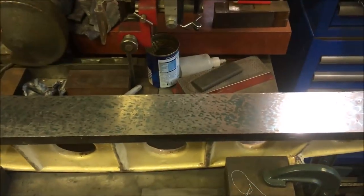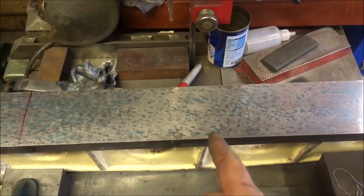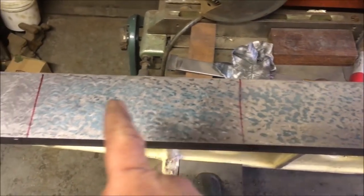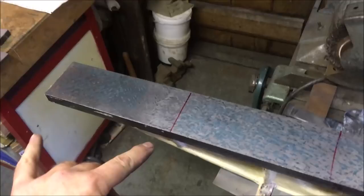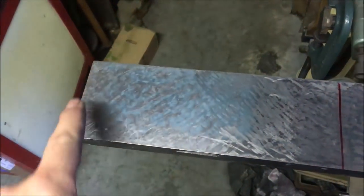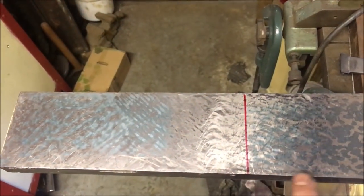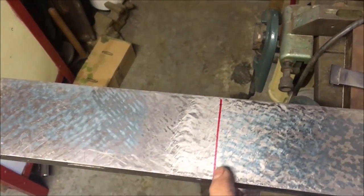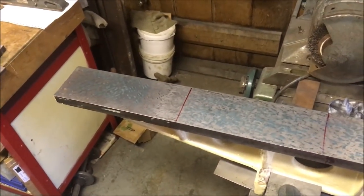Right, well, we've got a decent print now from that end to the first red line. And then we've gone from the centre 18 inches. And it's given us a relatively even print. So now what I'm doing is basically bringing in the last bit. So you can see that this area is higher than here. So I take that blue off and take nothing past that line. And then the subsequent prints should progressively lengthen out until they hit this point. My guess is about a thou to come off.